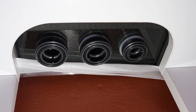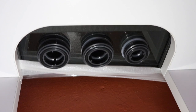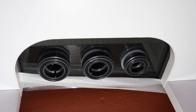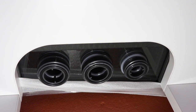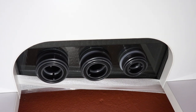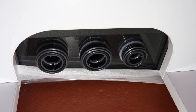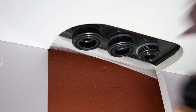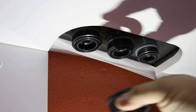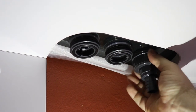Taking out those union insides made this a pretty easy deal. One thing I definitely want to mention is not to put a ton of pressure on those bulkheads because they can break the glass. In my experience in the past I've put them on too tight and cracked glass, so it's good to have them snug but not so tight that it could cause problems. First things first, we're going to take this union slash bulkhead and attach that to the return pipe.